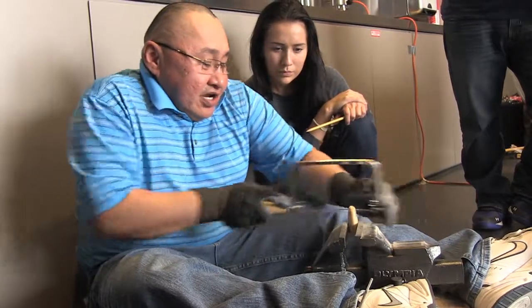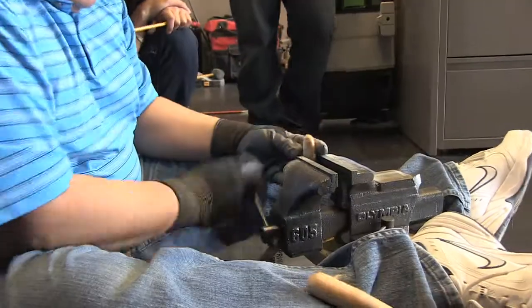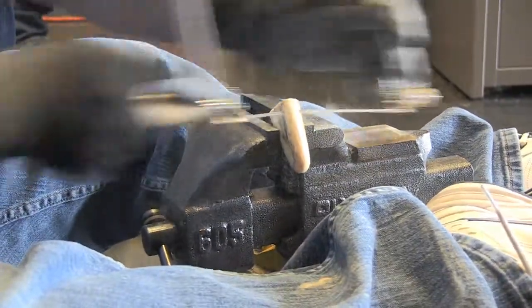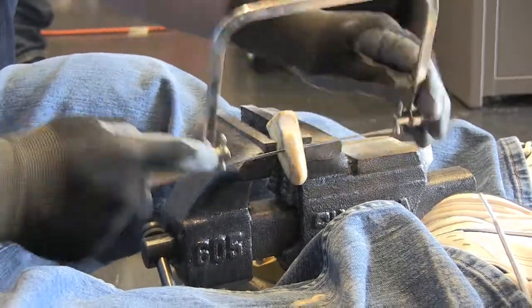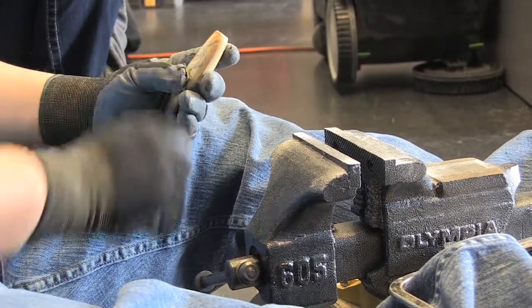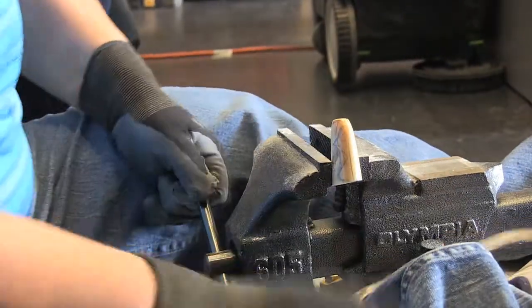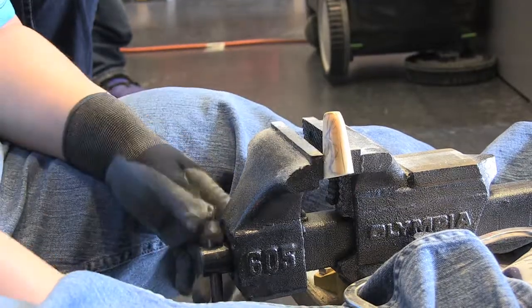There's a turn there — just turn it slightly a little bit and keep cutting. It's best to go a little bit on the outside of your lines. You can always take off but you can never add on. You can clamp that pretty tight without worrying about it cracking, just enough so it's not going to move while you're cutting or filing.